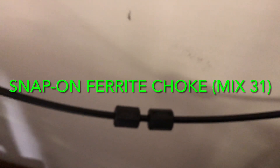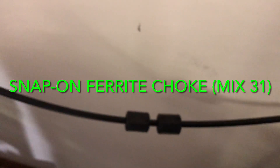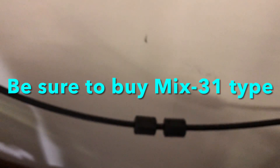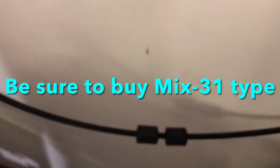Something as simple as that — snap-on ferrite chokes on your coax. I would do it on every antenna coming into your shack that is a multiband antenna. If you have an antenna that requires a tuner to operate on other bands — off-center fed dipoles, ZS6BKWs — put some snap-on ferrite chokes on the coax coming into the shack. It's still a good idea to have a choke balun outside, but you can have some leak-through.